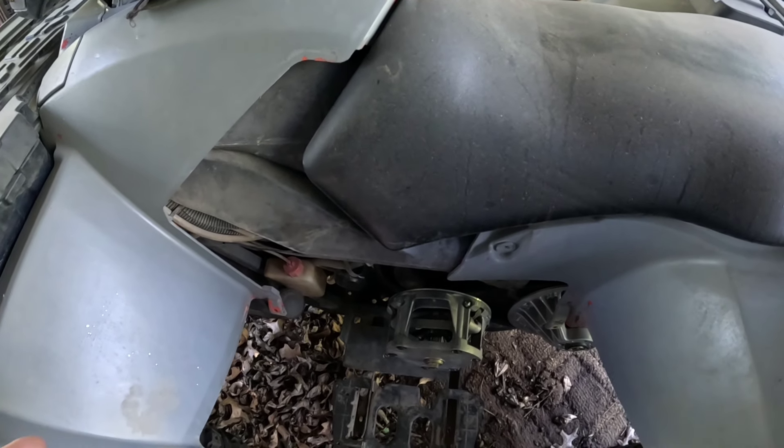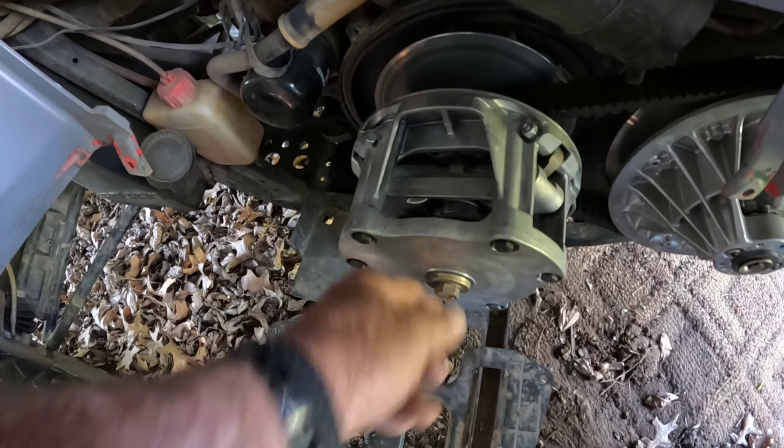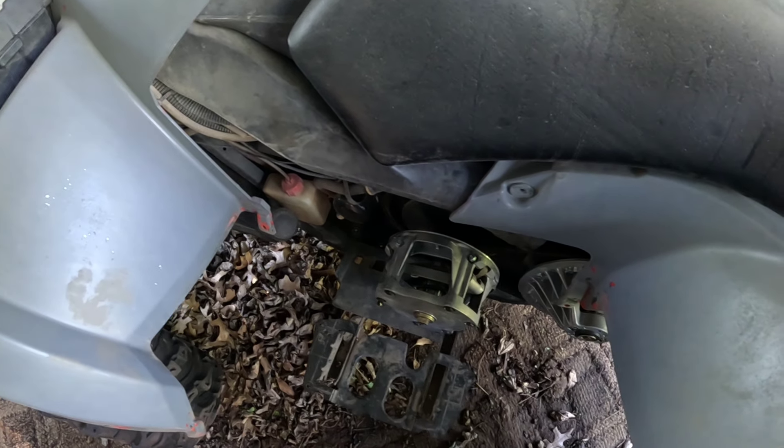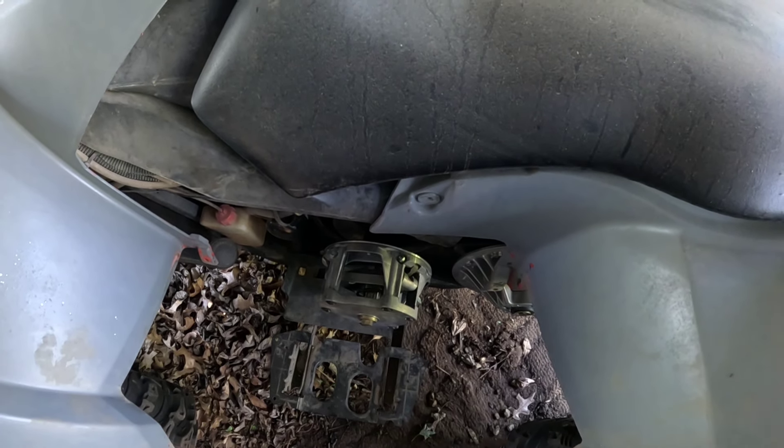Once you get the starter off, it's reverse order procedure putting it back together. Make sure you look up the torque on this — the torque on the front pulley bolt was around 140 to 160 foot-pounds, and the rear one is only like 30. I put blue Loctite on the threads of both to keep them in. I'm sorry we ended up not actually doing the complete repair on this, but a little bit of information is better than none. On old machines like this, if you want electric start they're going to go out, so you need to know how to put one on. He's going to pull start — I appreciate you watching, just stay tuned because no telling what else you're going to see on What's Broke Today. Thank you.